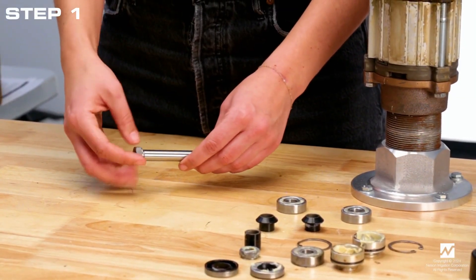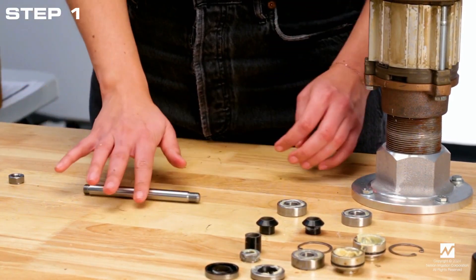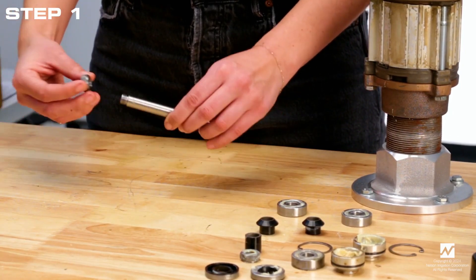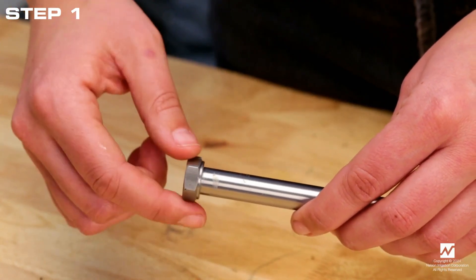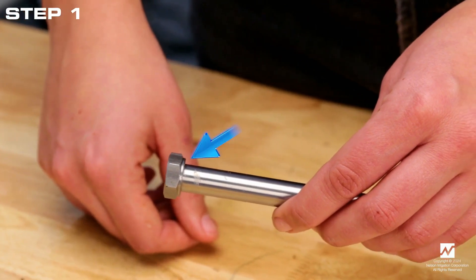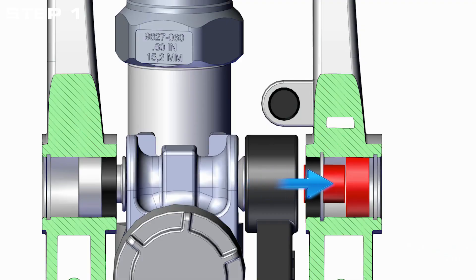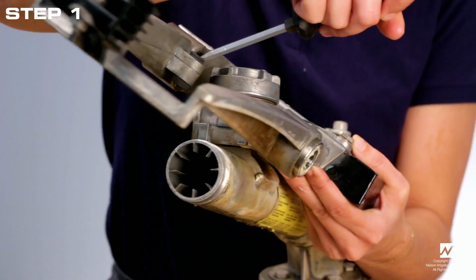Remove the remaining nut from the shaft and roll the shaft on a flat surface to check it for straightness. If it's bent, replace the shaft. Note that a new shaft is not included in the kit and must be ordered separately. Reinstall the nut on the straight shoulder of the drive arm shaft with the washer face of the nut towards the shaft, and screw the nut on until the threads seat against the shoulder. Using a screwdriver, insert the blade between the right drive arm bearing hub and the counterweight, work the blade against the spacer and slide the spacer and ball bearing as shown. Rotate the right drive arm bearing hub up and remove the drive arm from the big gun.